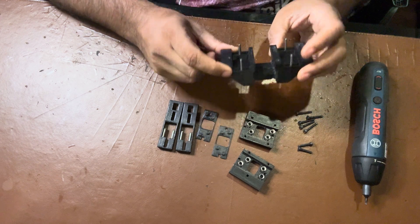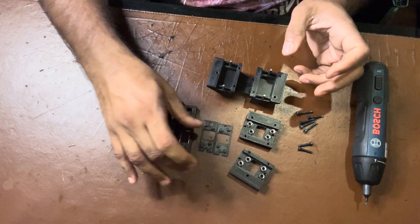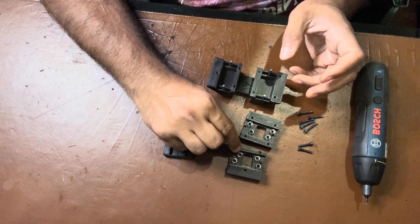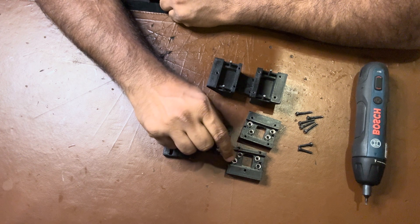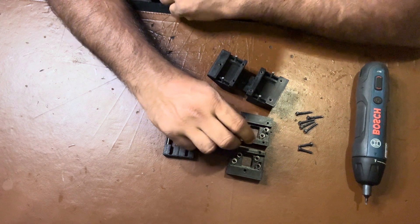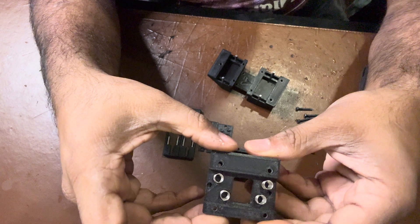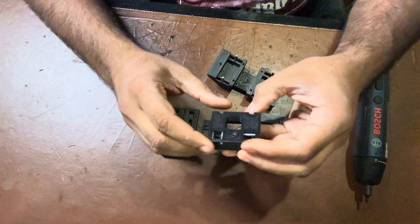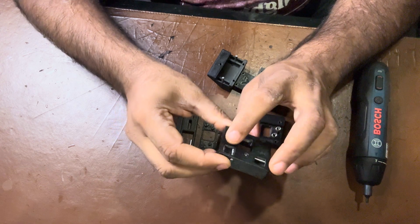The carriage itself uses the Archtype Breakneck mechanism, so that's the Archtype logo up there because this is derived from that. In addition to the printed pieces, you also need some hardware. These are springs: 12mm springs with 6mm outer diameter and 5mm inner diameter. We need eight of them — four for each carriage. They just sit in the holes that are designed for these springs on the tool bodies.